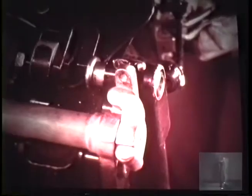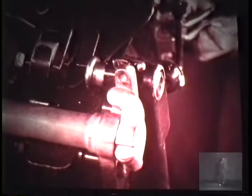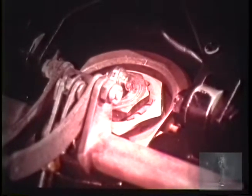At the same time, it causes the canopy to be jettisoned. The canopy is connected to the interlocked block by a cable, and when the canopy goes, so does the block. Now, as the air crewman continues to pull on the face curtain, there is nothing to block movement of the torque tube. The firing lever pushes the banana links forward. They pull the sear, driving the firing pin into the primary cartridge, and the catapult gun is detonated. The catapult gun provides the force required to eject the seat from the aircraft.